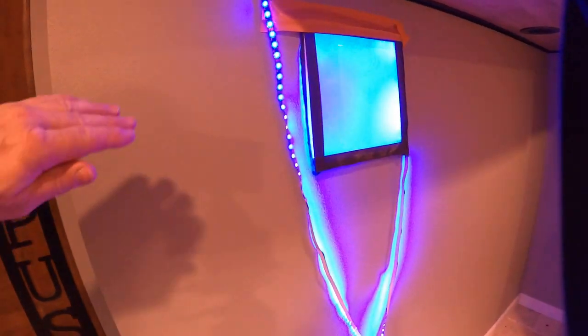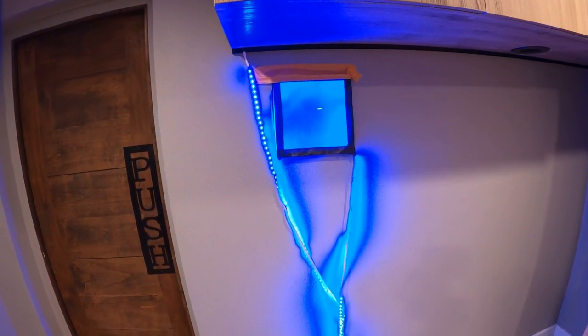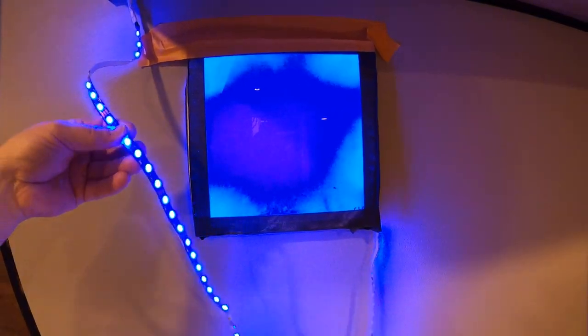The frosted material, I can just order it. So no issues there. And then the other reason on that, originally I was going to do a full sheet of good material from American Lighting. That ended up being about $500 a sheet times three. So it would have been $1,500 in LED lighting to backlight that. However, it was spotless at about a half an inch, so it did work as far as my specs go. But I think buying a $50 chunk of LED strip, of course it's going to be RGBW, it's lower wattage, so I don't have to worry about my transfer hinge. And then I'll edge wrap it around, gives us this nice smooth look, and then we'll cut it in.